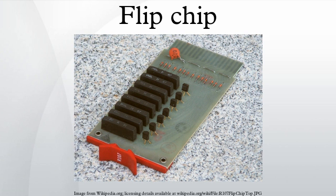Processing a flip chip is similar to conventional IC fabrication, with a few additional steps. Near the end of the manufacturing process, the attachment pads are metallized to make them more receptive to solder. This typically consists of several treatments. A small dot of solder is then deposited on each metallized pad.